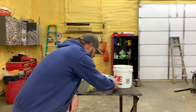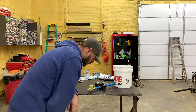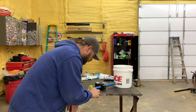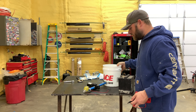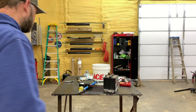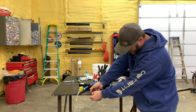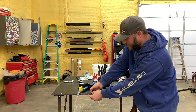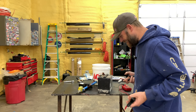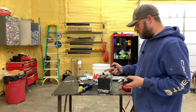Alright, we got our bucket, our line to the pump, our pump to the generator. I'm going to hook it up, run it, and see how many volts we have coming out of the generator. Got my little lawnmower battery. It's turning the turbine — I need to test this. I'm reading 18.3 volts on my multimeter, 18.4, 18.5. I'm getting kind of excited. We got 18 volts, so that should be more than enough to power the pump.